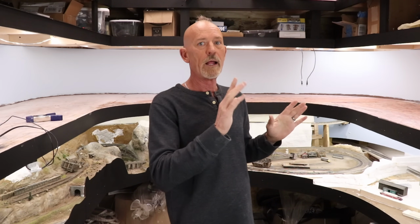Okay, now here's the thing, in my opinion, the drywall screws are there to hold the wood down so the glue can bite into it. I don't have to have drywall screws in after the glue's dried, but I'm leaving them in anyway as sort of a double measure, if you will. But if I needed to pull one because it was in the way for something, I'd just pull it out. But I just shot them all straight down in there except for in the back.